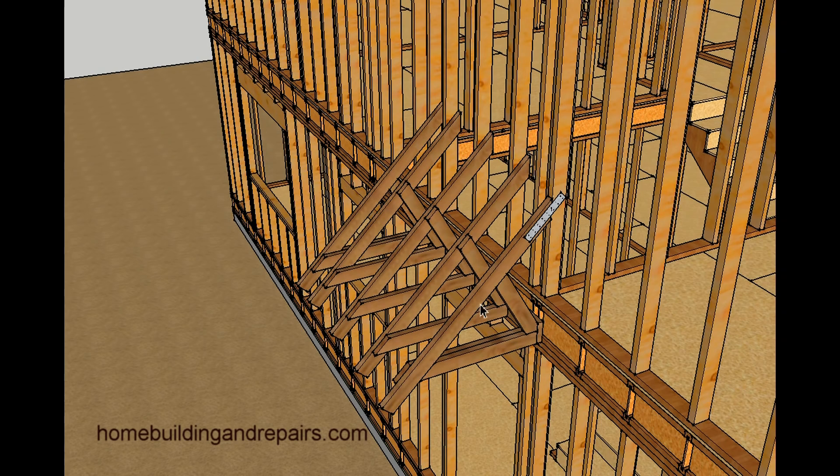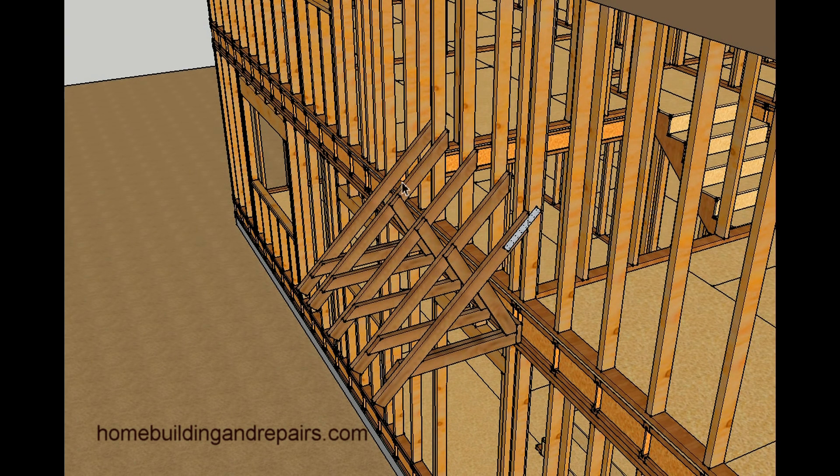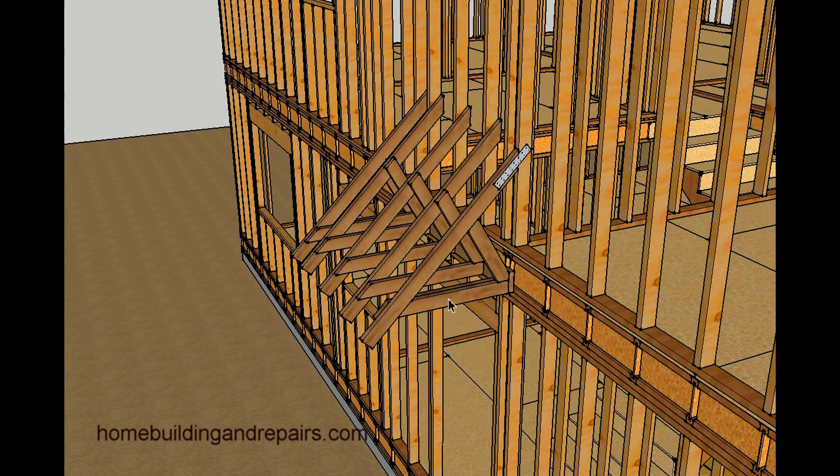These are examples — it might not work. I have built these before, and some of them turn out strong enough to climb on and jump up and down on. Others, not so much. If you were going to make a longer one going farther out, it puts a lot of pressure on the wall studs and could actually break them. In that case, you might want to put a 4x4 in or replace the studs. Always seek the advice of a structural engineer for something like this — I definitely recommend that.